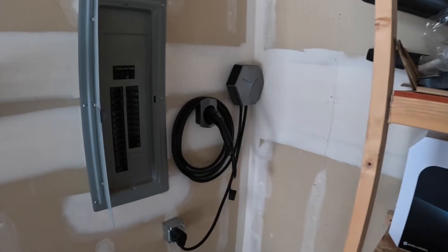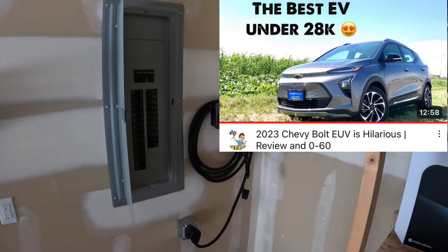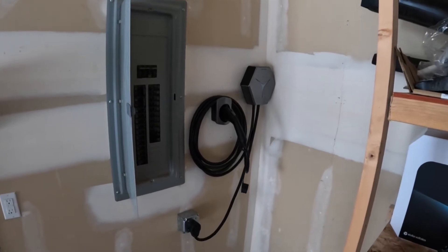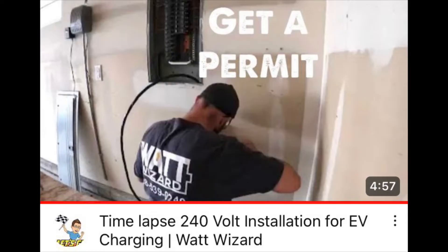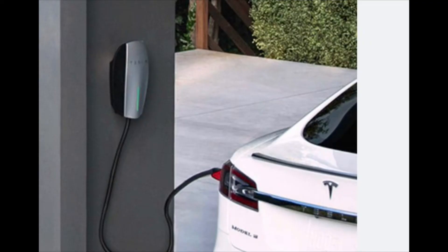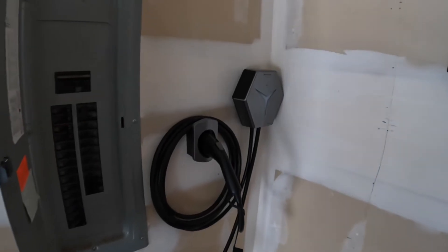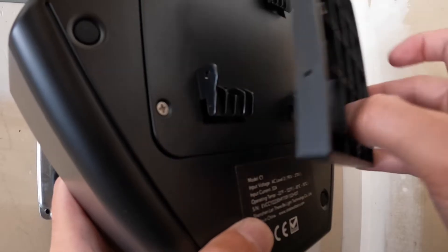If you're new to my channel, I don't currently own an EV, but I regularly drive them when doing car reviews, so having a charger like this is a handy thing to have access to. This one's pretty simple — it plugs into a NEMA 14-50 outlet, which is a 240-volt outlet protected by a 50-amp breaker. I recently had mine installed by the Watt Wizard; you can find that installation video on my channel if you're interested. In addition to the plug-and-play characteristics of chargers like this, there are also wired-in chargers, which are a slightly more permanent garage setup. They can cost more, and overall that's not the route I wanted to go — this thing can easily be moved or repositioned if ever needed.